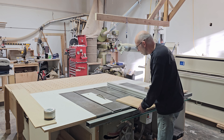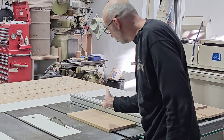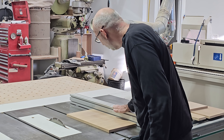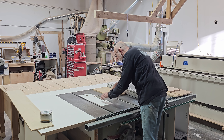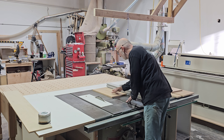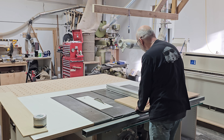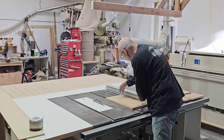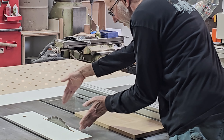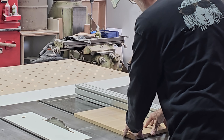When you're putting material through, your pressure is at an angle to the fence and you glide it through like that. Don't stare at the blade — you can have the blade in your peripheral vision, but you need to keep consistent pressure against the fence, especially in the area where the saw blade is. That's critical.